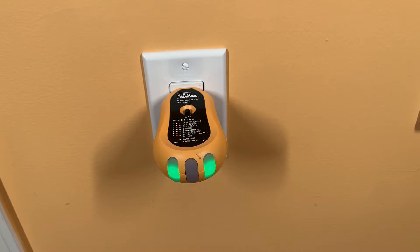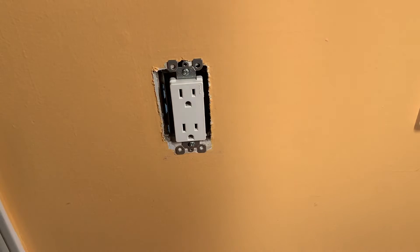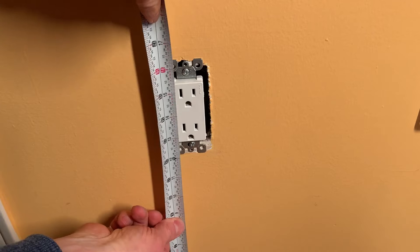The first thing you need to do is figure out where the box needs to be positioned. If you're adding an outlet in a room that has other outlets, you want it positioned at the same height from the floor. First, plug a tester into an existing outlet, then turn the breaker off. You never want to take the faceplate off or look at a box without the power being turned off first. Then remove the cover plate and measure the distance from the floor to the bottom of the box — make sure you're measuring to the box, not just to where the outlet is.